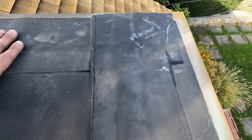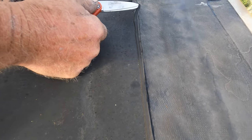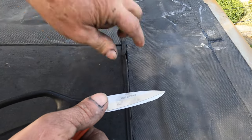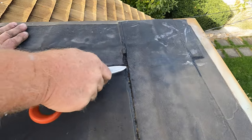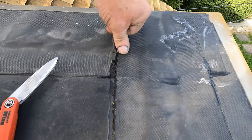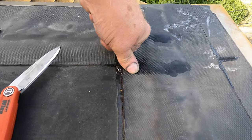The way they try to fix it is put caulking — see the caulking? This caulking doesn't do anything. It gets hard and it rises up. Caulking just rises up, doesn't mean anything. It's open there. See how I can bring water over? Because it's over a seam. It's always going to leak there.